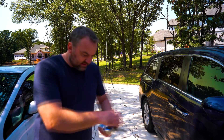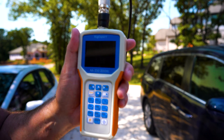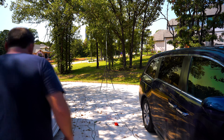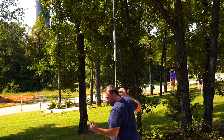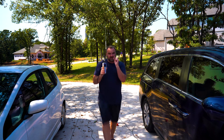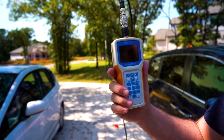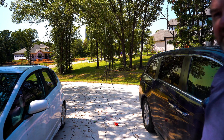I was hoping I didn't make the SWR worse — and I did. It's now 1.57. But then by raising it up and moving the coil up a little bit, I got it back down: 1.3, then 1.1. As I walk over here it gets a little worse — 1.2 — but anyway, that's plenty good enough. That's the antenna. Let's hope it works in the field.